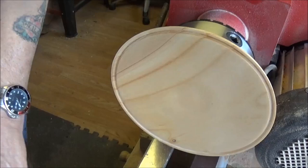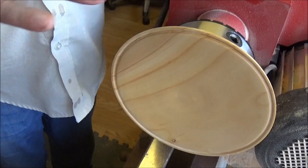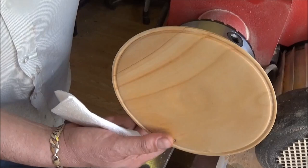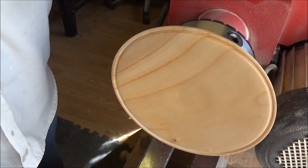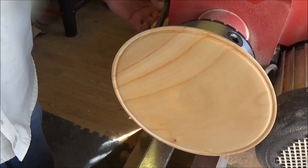That didn't take long, but then again putting it on never does. Now I'm going to let that just dry for a little bit — feel it's on there. I'll leave that for a couple of minutes to dry off and then I'll buff it up and show you the results. I've left that for a few minutes now and it's not so sticky to the touch — it's just about dried off. So I'm going to buff it up at medium to high speed, about 1000 to 1500 revs, with a medium to soft paper towel.